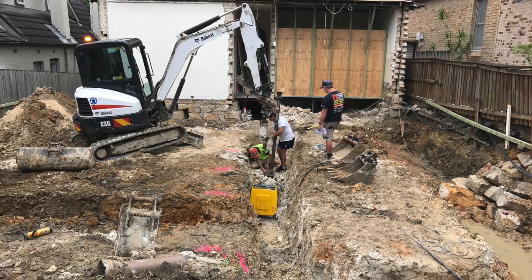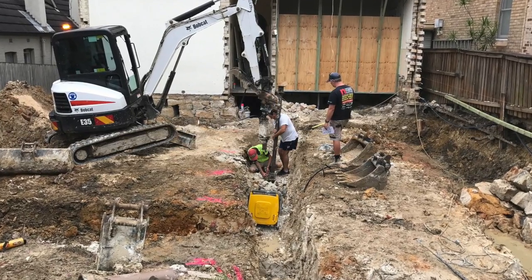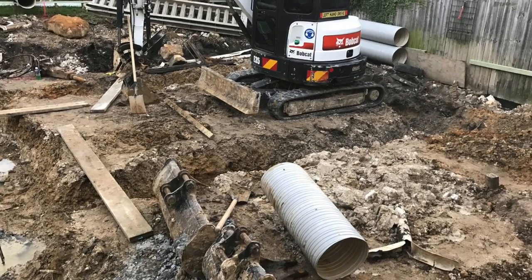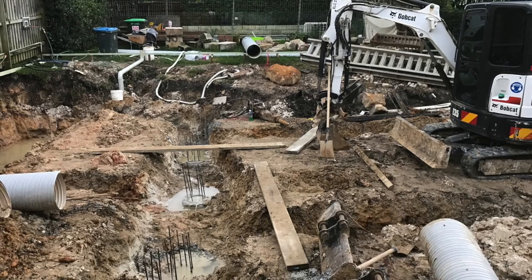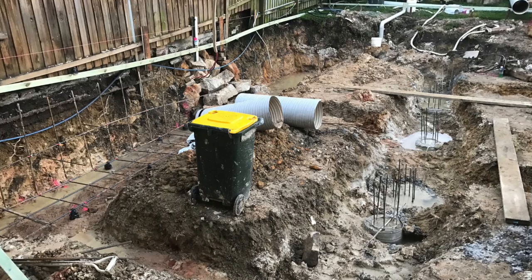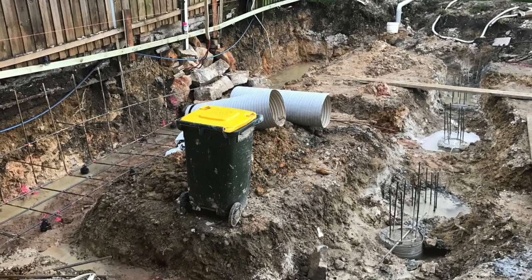Footings here, I saw you doing piers and then bricked up. It was a pier and beam over the clay, where we had to bore down to rock, so everything's on rock. Okay. And the trench mesh through and poured through. It's a 600 by 400 footing. There was a vein of clay through there. We piered down till we found rock, 3 metres at the highest point.